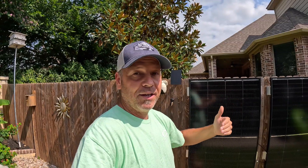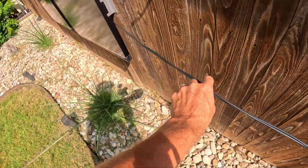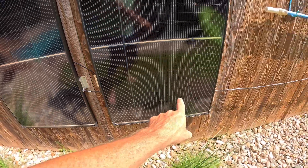I like these because they have a black anodized frame, so looking at it from my street it's not a super ugly eyesore since you can see through the backyard. Since I'm not going up through the roof, I used 12-volt landscape wire for the cabling. Nothing's really mounted permanently, but the landscape wire just goes behind the solar panels. I got a hundred feet of 10-gauge 12-volt landscape wire — it's actually rated up to 1,000 volts, which surprised me on the spec sheet, though it's not rated for interior wall use so I didn't run it through my attic.